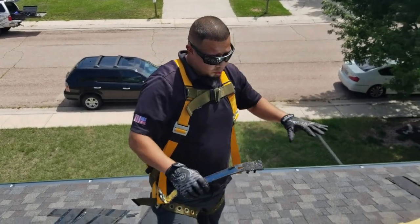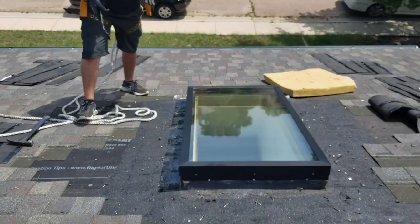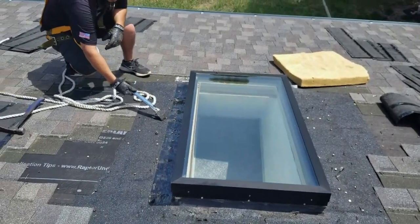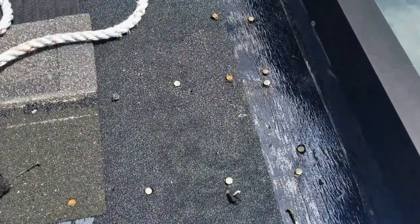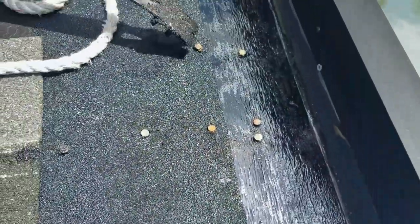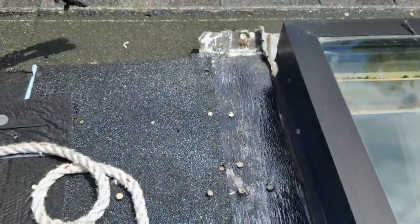You can see we have the majority of the shingles around the skylight removed. We just have to pull some of those nails off and clean it up. But I wanted to show you — if you look at these nails right here, you'll see rust starting to form on top. There should be absolutely no reason why they should have rust — they should look like these other nails. Because they're showing rust, I know water was getting behind here and leaking through these nails. It's very likely that's where the leak is coming from — these nails are allowing water inside underneath the flashing and causing a drip.